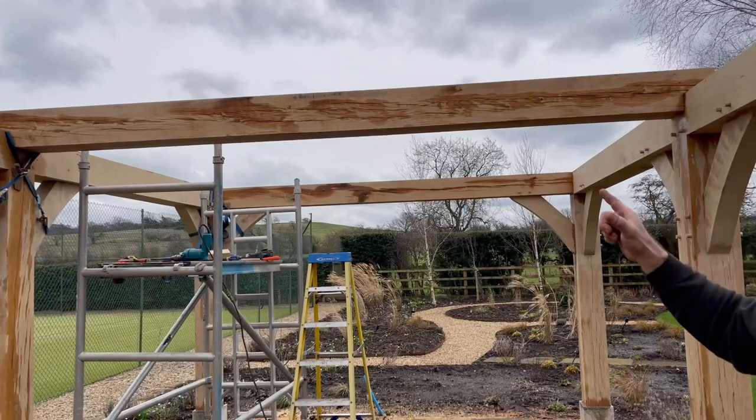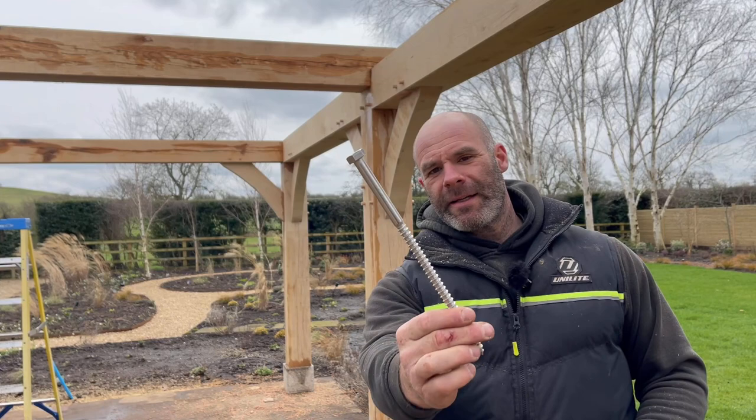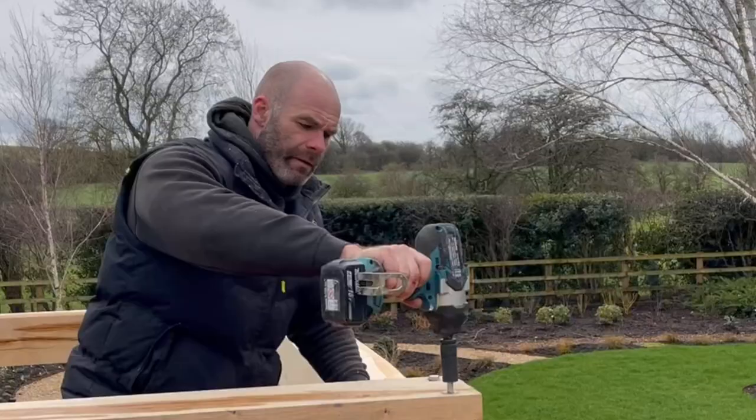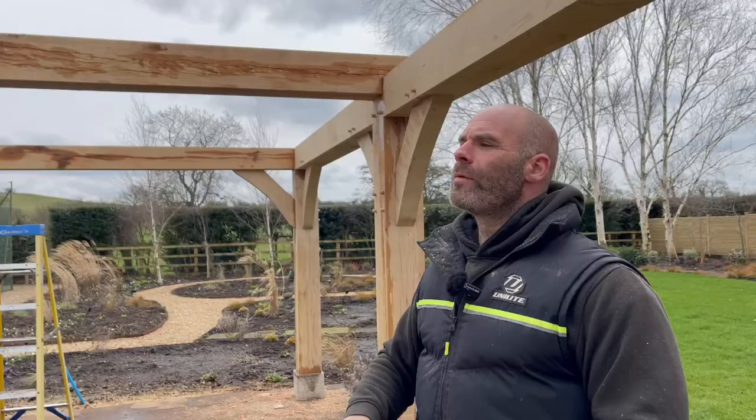As well as routing a groove, we also installed the collar tie — that's the beam in the middle. The purpose of that is to attach the left and right sides so that they don't bow out under the compressive force of the roof when that gets put on. We attach that with very long M12 stainless steel coach screws. Going through the installation process, the half laps on the corners — we like to put some stainless steel bolts through them just to make sure they don't move around as we add components to the frame.